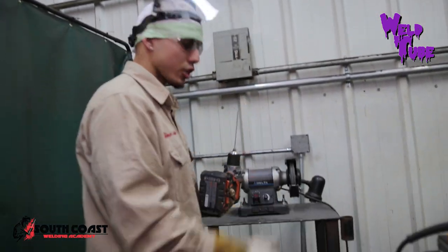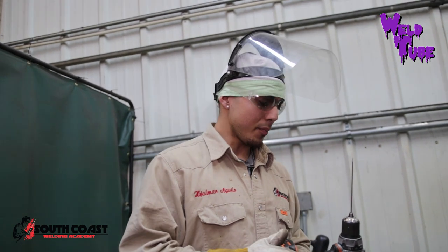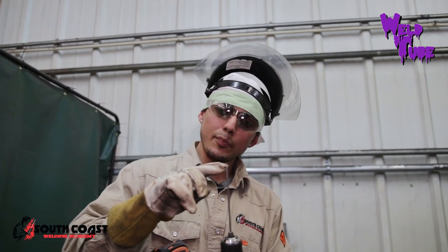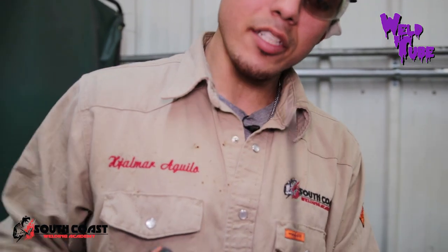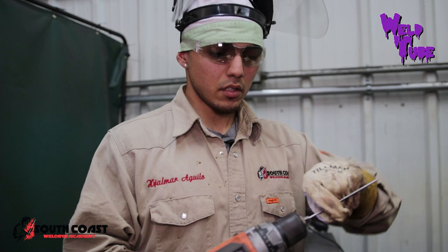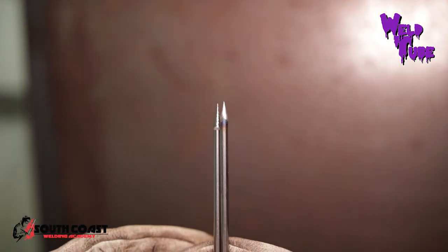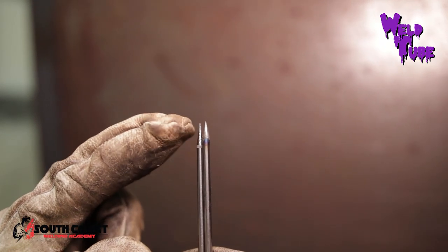Those are the ways you can grind your tungsten. The tungsten grinder by hand and the drill are the proper recommended methods — the angle grinder is more of a safety concern and I wouldn't recommend it in the field, but it is a possibility. For tungsten types — 2% lanthanated, E3 ground, or 2% thoriated — whether it's 1/8 inch or 3/32, you do the same thing. Here you can see one end is long and pointy, and the other side is short and pointy. Everybody has a different preference on their tungsten grinding, and both will do the job.